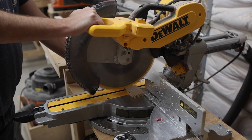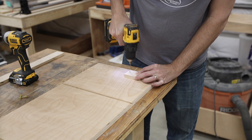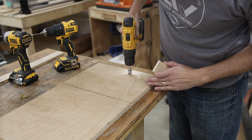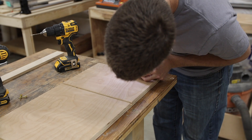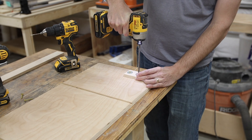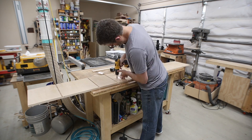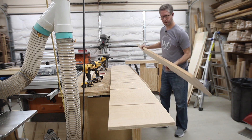I grabbed a piece of half inch plywood I had on hand and ripped off a strip. I'm going to cut these into smaller pieces and use them as hold downs and stops later. I've found when putting a couple of pieces together like this, it's helpful to use a slight countersink on the underside of the top piece and the top side of the under piece — it just helps the two pieces seat together much more nicely. I pre-drilled all the stop positions based on different sized boards I'd likely use.